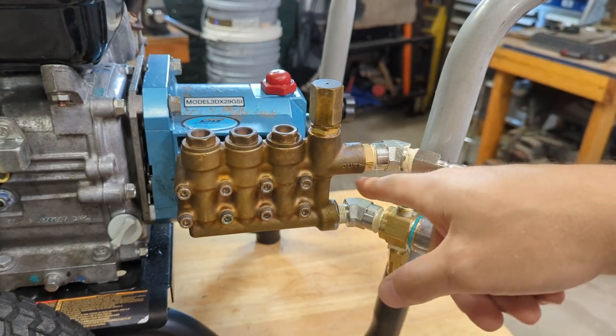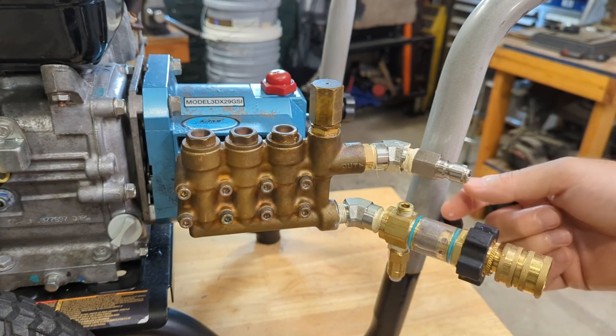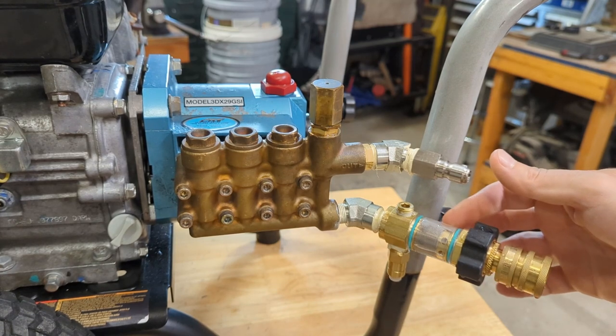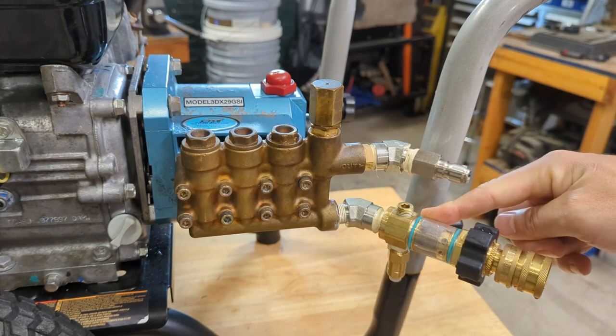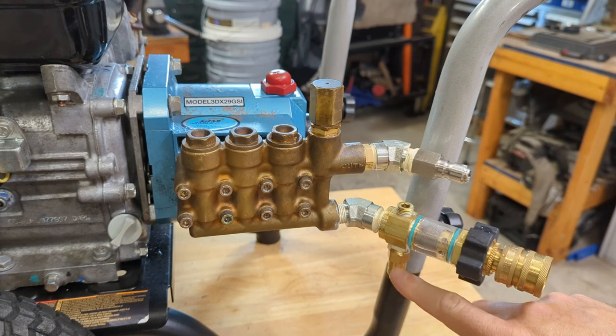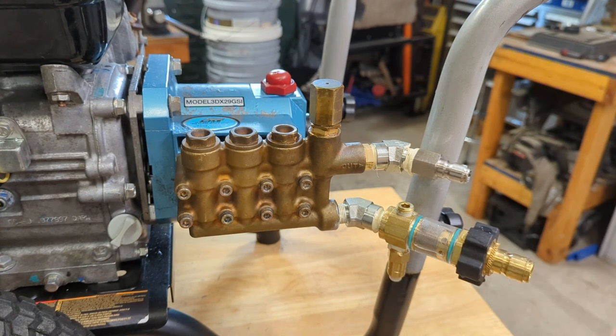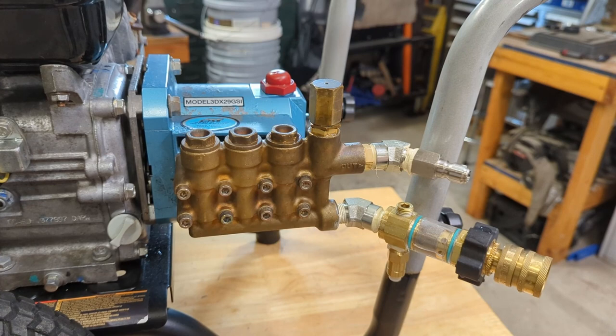Down here on the inlet side, we got another 45. We have this strainer. This is a general pump part. I can leave the links in the description for this thing. It's like maybe 25, 30 bucks. It's got a screen on the inside that'll filter out any particulate matter so it doesn't hit your pump. And we have a thermal relief valve down here that I think is calibrated to 140 degrees. So if the water gets too hot, this will open and dump water out. And then we just have a regular brass quick disconnect for the garden hose. So that's that. Not much to it. We got oil in the pump, so let's give her a try.